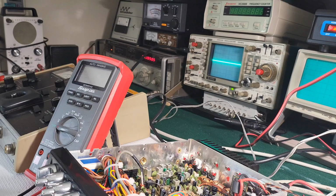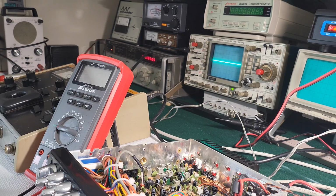Yeah, so the only thing, I'll probably make a part 2 to this radio. I'm going to reach out to the owner, see what he wants to do. I'd hate to tell him this thing needs to be recapped. I know the radio's not that old, but I think it could really benefit from having some better caps in there.